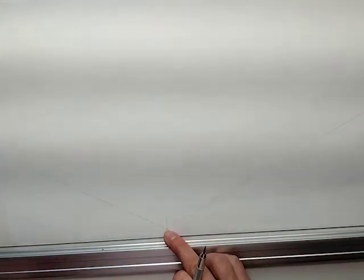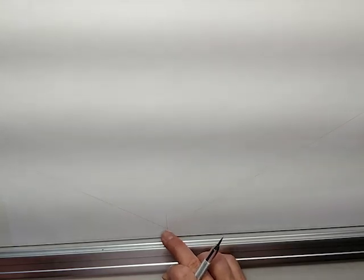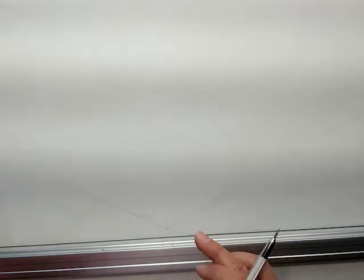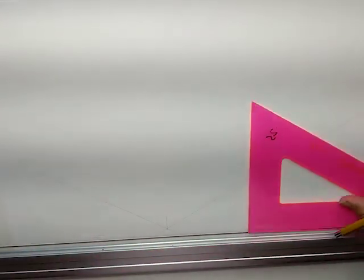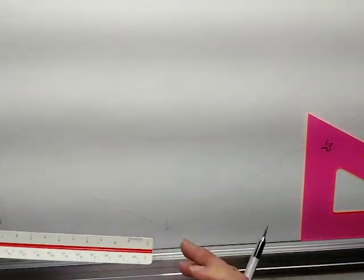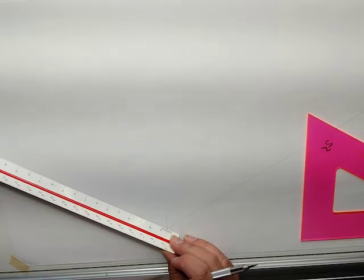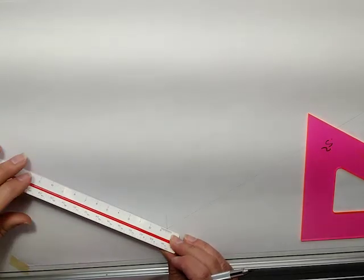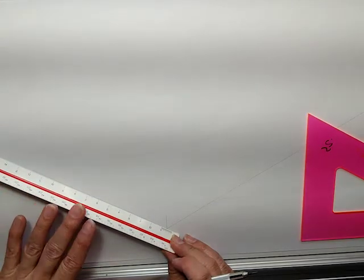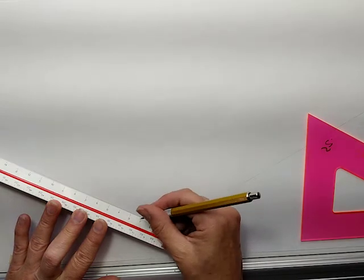Starting here at the base, the bottom — this is the lower right-hand side of the first riser, and there has to be four of them. The stairs are 3 foot 6 wide, so I'm going to get my half inch scale and measure 3 foot 6. The cool thing with an isometric is that you can take an accurate measurement anywhere on here. There's my 6 inches — 1, 2, 3.